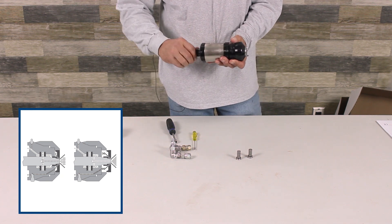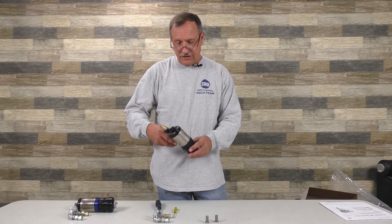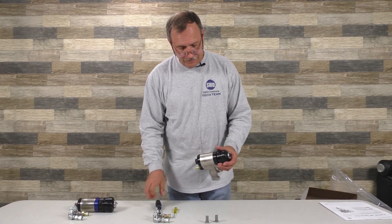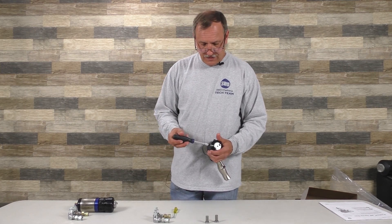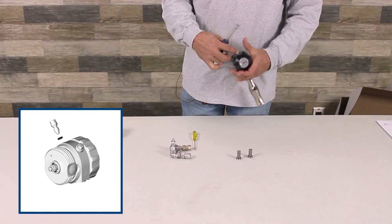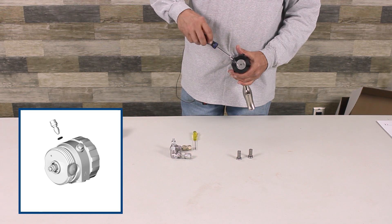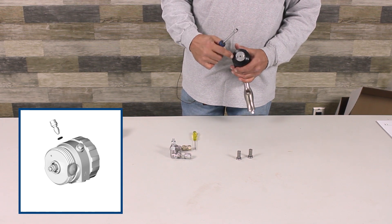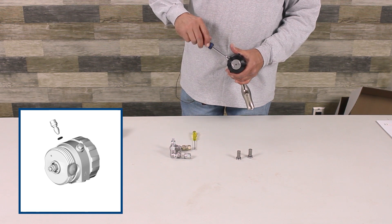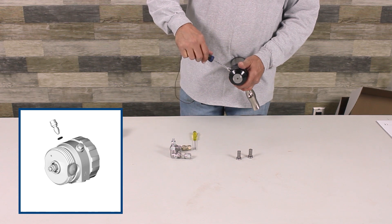Always make sure if you're not holding the gun the safety's on. That makes sure in case you drop it or somebody grabs the gun and triggers it, you're not going to spray anybody. There's an air valve right here — this is pressurized in front of the gun and controls the amount of pressure that comes out around the mixing chamber and around the cap. By factory specs it's supposed to be closed, then open to a quarter to a half a turn.